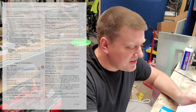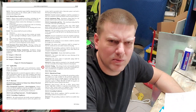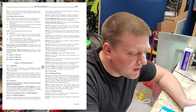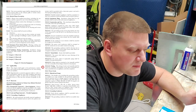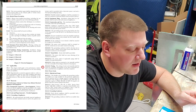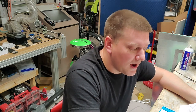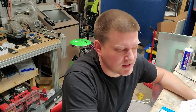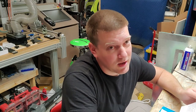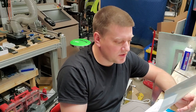On page 99-99, in section 10.2.2.3.8 — Testing — it says: the wiring of each cord assembly shall be tested for continuity and polarity at the time of manufacture, when assembled onto an appliance, and when repaired. That pretty much sums it up: you have to test something when you repair it to make sure it's electrically sound. It doesn't say how often or what type of test — just that it needs to be tested.